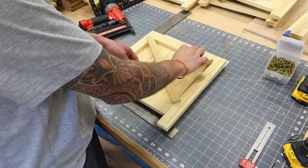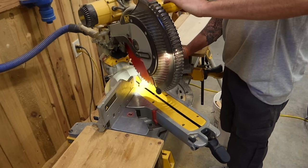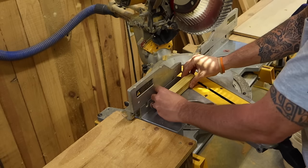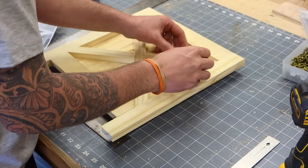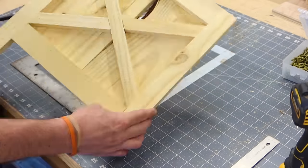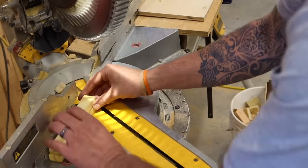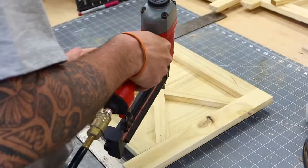Now let's move on to the X-frame. For panel A, I'm calling this Long XA. Using the part from the description, I'm putting a 35 degree angle on one end, sliding it straight down and putting a 35 degree angle on the other — fits right in. For the two parts labeled Short XA, I keep the saw at 35 degrees and make that cut, then change the saw to 21 degrees and flip the board over. With all X parts cut we can assemble — I'd recommend gluing and brad nailing, which should be all you need since these are just decorative pieces. For panel B, Long XB is cut at 36 degrees on each end and Short XB is 36 degrees on one end and 18 degrees on the other.